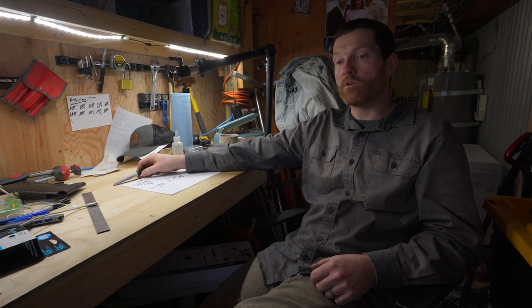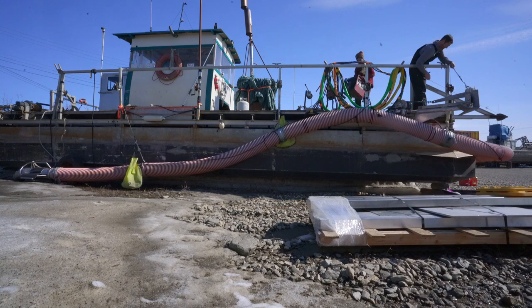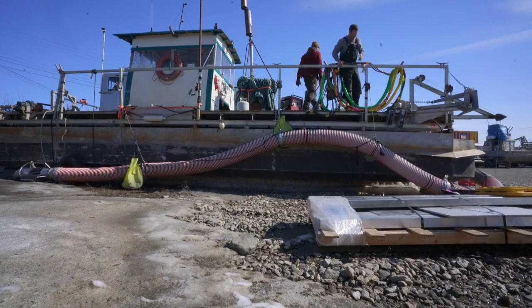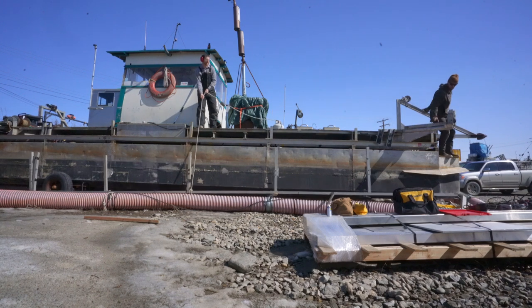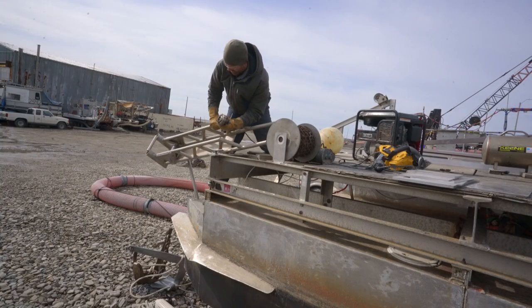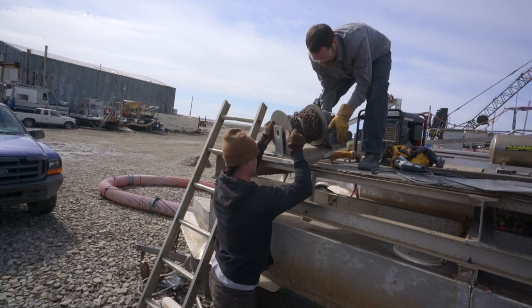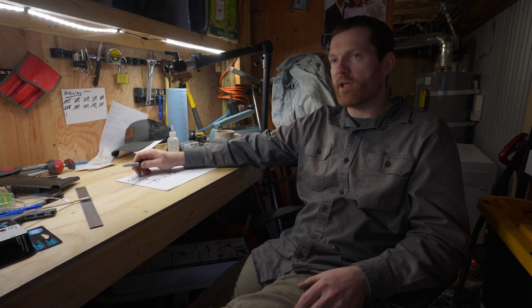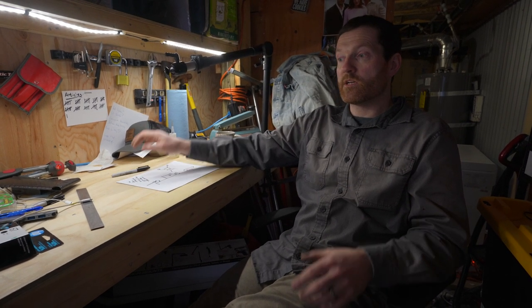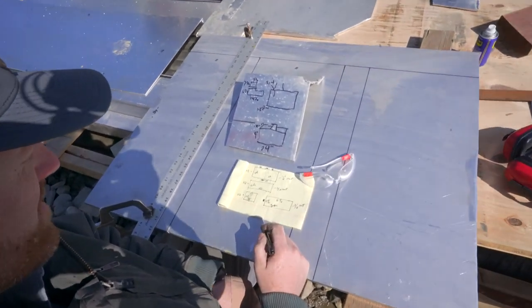The first thing to do was cut off all of the old anchor system — demolition all over the place. We just started cutting things off, cut off handrails, getting the boat clean so that we could design from the frames up. All the aluminum had to be shipped into Nome ahead of time, so there was a material use plan where we had to design everything and make sure we had enough metal. We got just enough material to do everything we wanted.